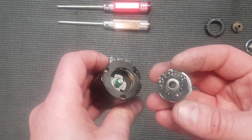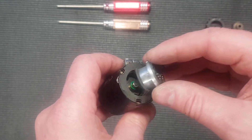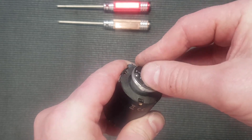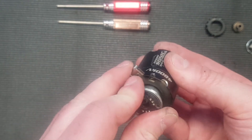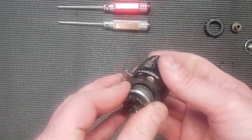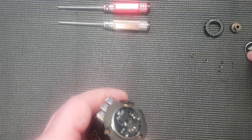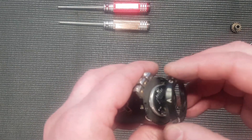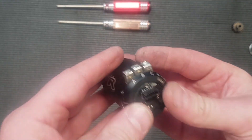We've got the sensor board, which has the bearing that needs to go over the shaft there. I've got a little bit of a wiggle — it's a bit of a fiddly process just trying to wiggle that onto the bearing. I've just pushed the armature out a little bit — that's in there. This won't all feel right until we get the whole motor back together. Now we have the end bell — line those tabs up there, and that goes on like that.